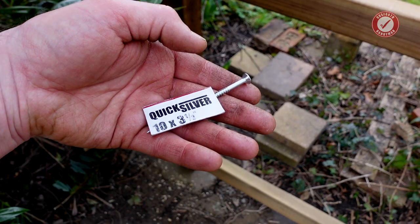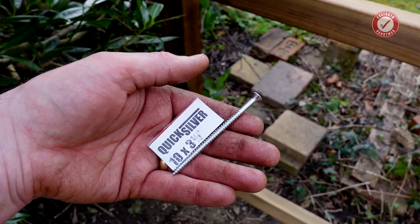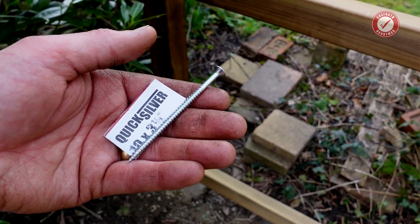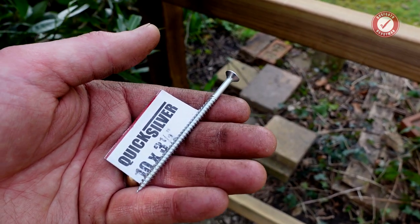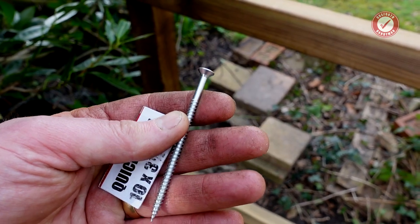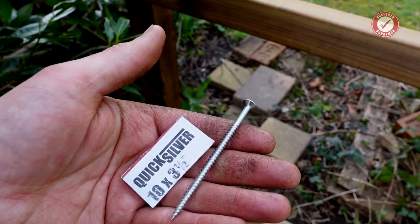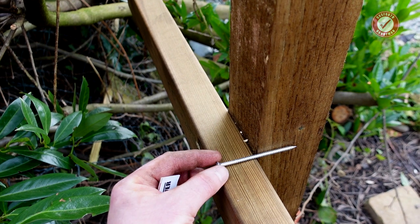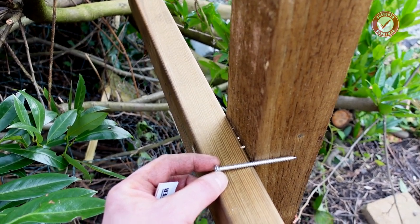I am using 10 gauge by 3.5 inch Quicksilver screws. If you haven't already watched my video about how quickly wood screws rust, then I'll leave a link in the description below. If you want to go belt and braces, then use treated deck screws and stuff, but honestly, I've had bad experiences with those, and I know where I am with these, and these will last a lifetime. They're incredibly hard screws, and you can see how far they go into the post. They go a good halfway into the post, if not further, once they're counterbored a little bit.